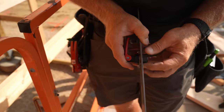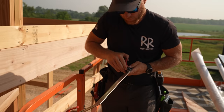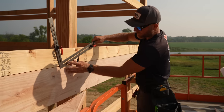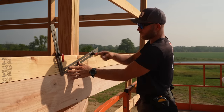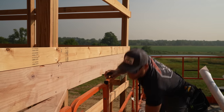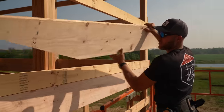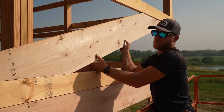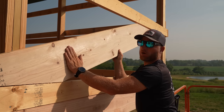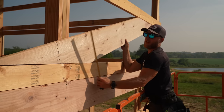You flip these over so that one is always pointing to the right numbers on both sides, slide it back over until it's basically tight, and now we have the right pitch. This is the 4/12 pitch — this is exactly where my roof line is going to be. I basically just need to be just a little below that, because all this 2x12 I'm putting up is so when I have my steel come down and my roof line is here, I want a place to have my flashings up against the wall — something solid and a place to screw my steel. My flashings are about five and a half inches.